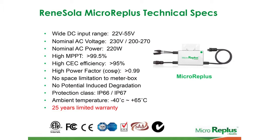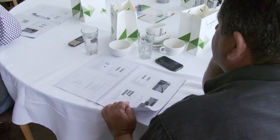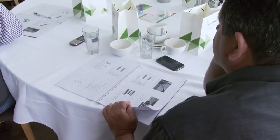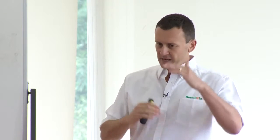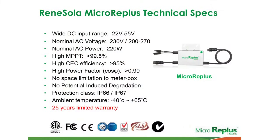The CEC efficiency is the efficiency of the system in terms of the DC to AC conversion. Typically speaking, you're going to lose about 5% in output over that conversion, and that's fairly standard across the industry for any type of inverter. That 95% CEC efficiency is your average based on higher and lower temperatures, but what we do see is that it's a fairly narrow range, which is a benefit — you want to know that efficiency is fairly steady regardless of the temperature.